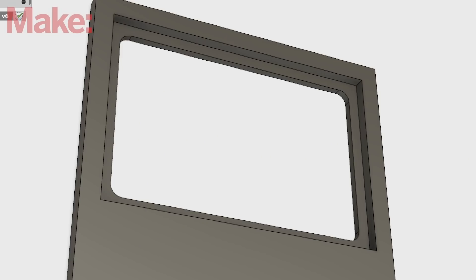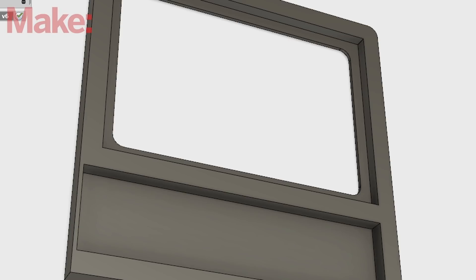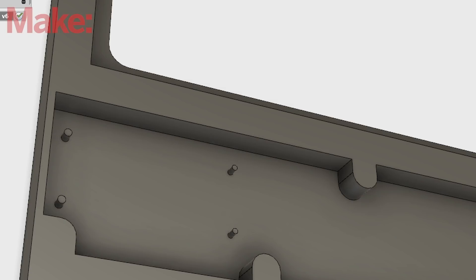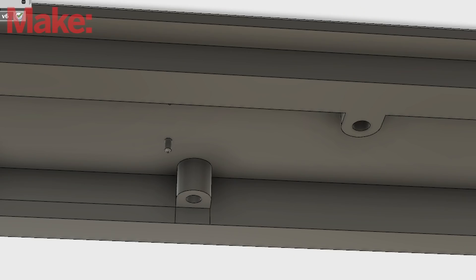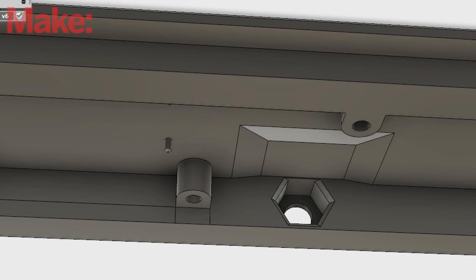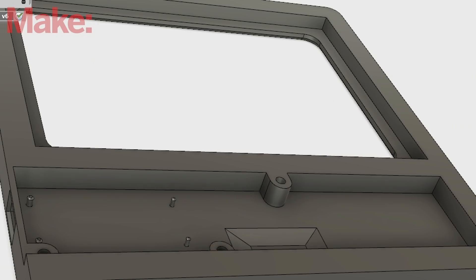To design the enclosure I started with a cavity for the acrylic sign, then hollowed out a cavity for the electronics. I added some pins to help keep the microcontroller in place and I added a port for the USB connector — I might need to modify the code and I'll definitely need to use it to charge the battery. Next I added a hexagonal hole in the bottom for a quarter-twenty captive nut to attach the sign to the camera, making sure it's the right size for a tight friction fit. Finally I added the bosses and holes for some M3 threaded inserts.